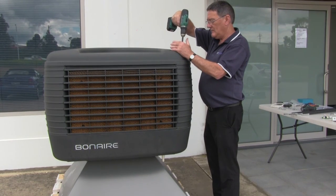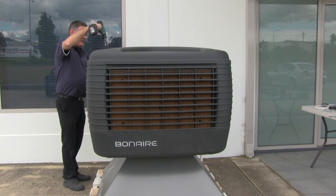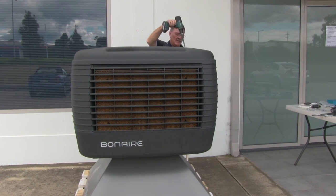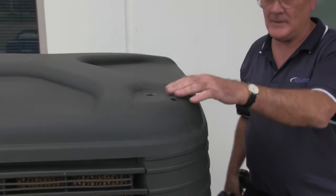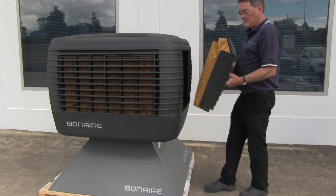All Pinnacle Solar units come with pre-marked indentations — four for each corner rod and one for the micro-inverter cabling. Please be careful to drill through the lid only and not to damage the water distribution tray. We recommend you do this at ground level.